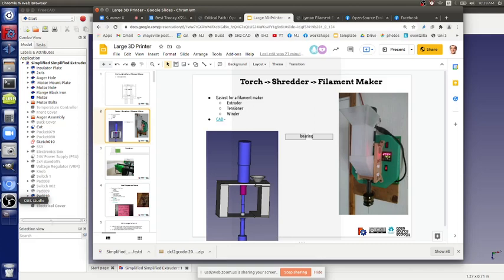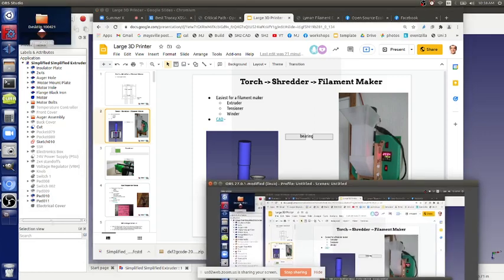So you can do that, but there's companies that do that, and that's actually an awesome area for R&D, like how do you work out... There's a thing called metal injection molding. How do they do that? It's metal powder in a plastic matrix, and then you burn out the plastic and you get a 100% sintered metal structure. It won't have great strength, you've got porosity, but that works. That's how some of these companies do it: you print your part, you bake it, and then it's a 100% metal part.